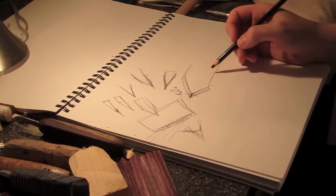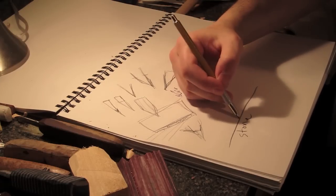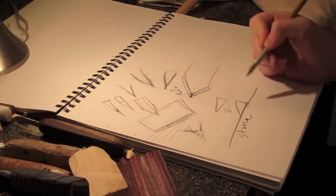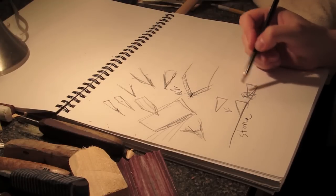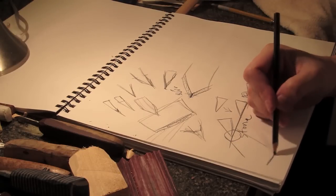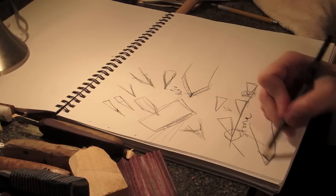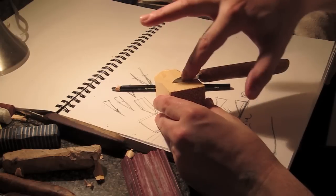The burr will be bigger and thicker on rougher grits and gets smaller as you work down. Whatever stone or sharpening device or sandpaper you use, the bevel has to be flat on the stone. If the tip is up, you're doing nothing — you'll never get it sharpened. If it's too far forward even slightly, it takes the edge off and makes it too steep, and when you flip it and make the same mistake, it doubles up and gets even steeper.